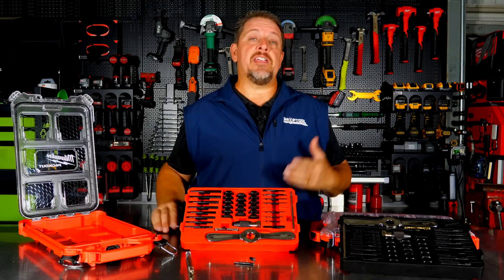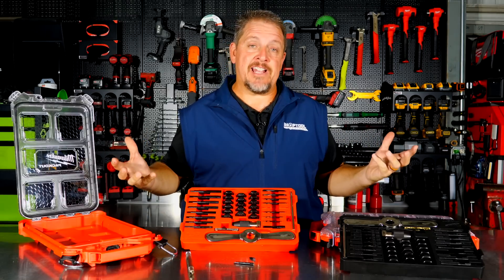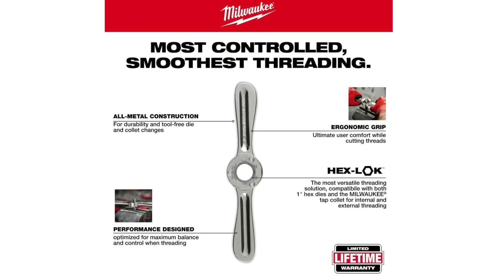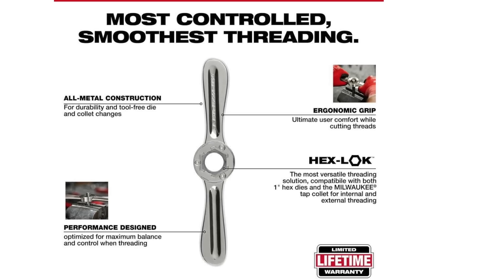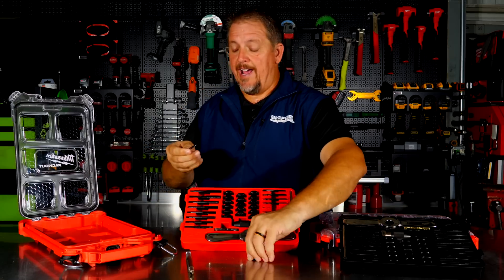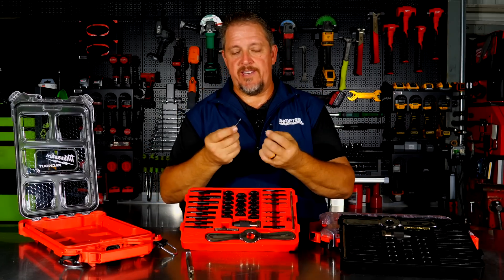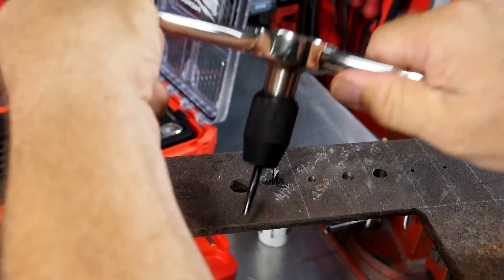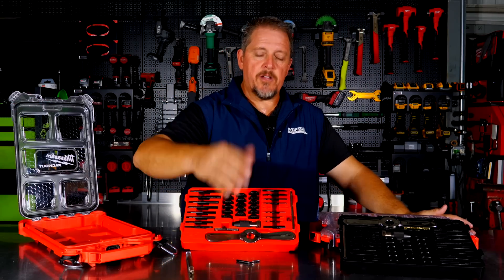Both the 5603 and the 5604 SAE and metric sets are each $199.97. I'm not exactly sure whether or not these are covered under lifetime warranty. I'm pretty sure the tooling side — like the handle and the die holder — is covered under their lifetime warranty, but I don't believe the taps are covered. I'll try to get details and leave them in the description, because we know taps are going to break. To be completely honest, I broke the 10-24 when testing — I got it in crooked and torqued a little too much. That is not a factor of Milwaukee quality; these aren't chintzy taps. But when you're dealing with smaller taps, if you're not very careful, you will break them — they're very hard and very brittle steel.